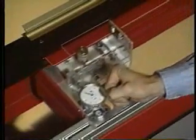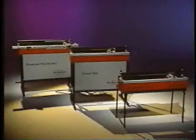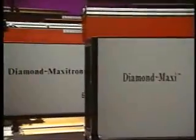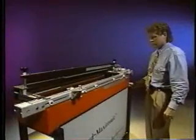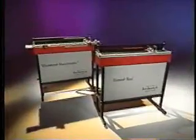This makes sharpening simple and repeatable. Although the Diamond Maxi is still considered a manual sharpener because the operator moves the head along the squeegee blade, virtually every other variable has been eliminated. The Diamond Maxi can be ordered as a tabletop unit or may be coupled with an optional stand and vacuum system to remove squeegee residue during sharpening. The Diamond Maxi offers superior edge quality and consistency in a mid-sized manually operated sharpener. If you prefer a fully automated mid-sized sharpener, the Diamond Maxi-Tronic adds the advantages of hands-off operation. Secure any squeegee up to 37 inches long, set the required number of sharpening passes, and flip a switch. The Diamond Maxi-Tronic does the rest. Even the cutting depth is controlled at 3.5 mils, but you can override the system for even greater control. The Diamond Maxi and Maxi-Tronic are supplied with two standard square heads, but all the shaped wheels are available as optional equipment.